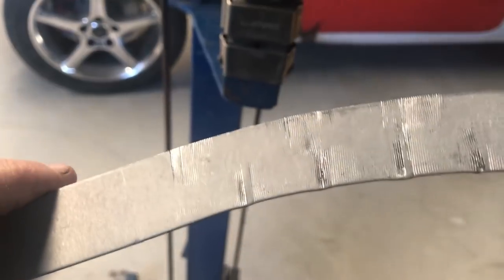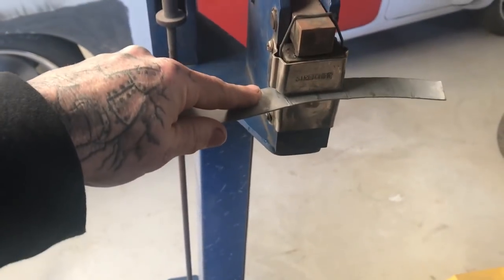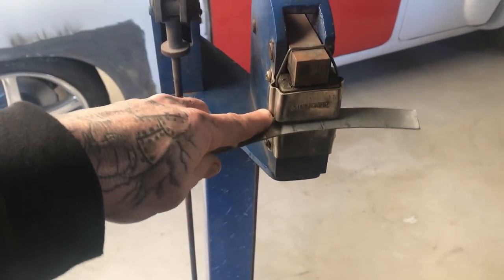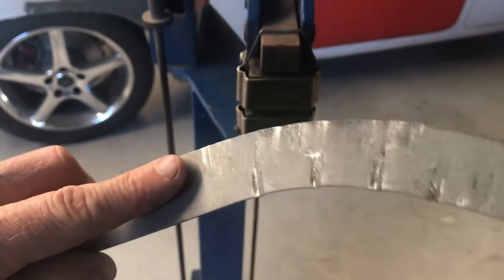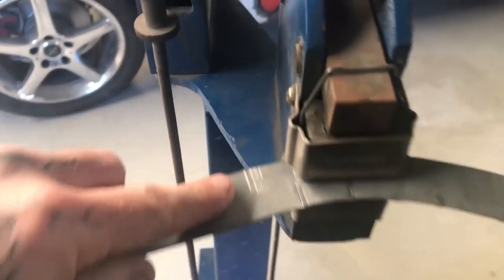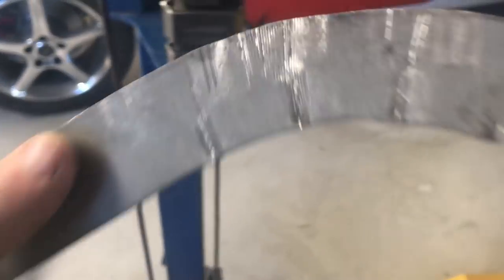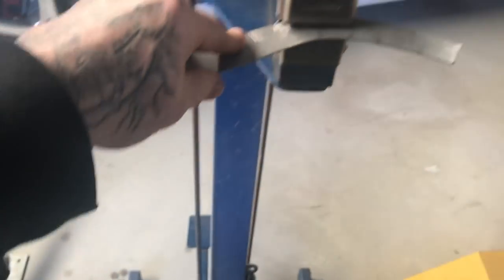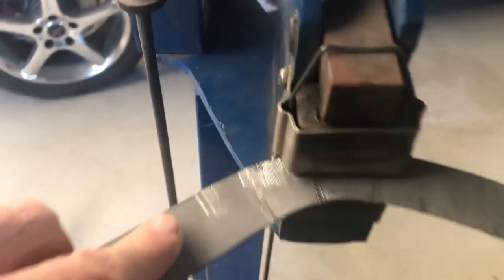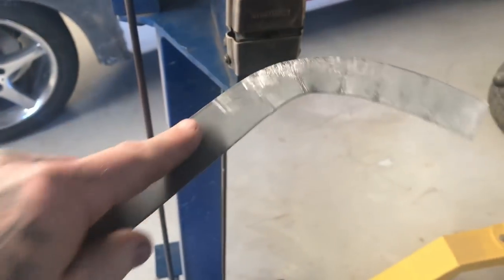With stretching it is possible to physically tear the metal if you stretch it too much. If you keep trying to stretch a shape that's really tight, these do have the strength — especially the foot-operated ones — to tear the metal if you work one area too far. It's just a thing to be wary of: if you're not careful, you can potentially ruin a lot of time's worth of work by splitting the metal at the last minute.